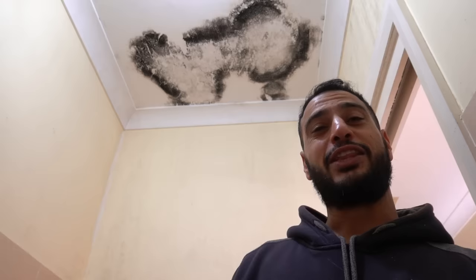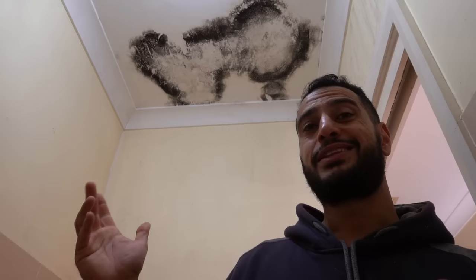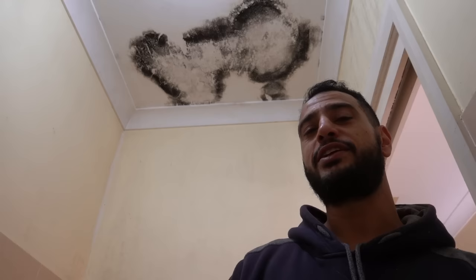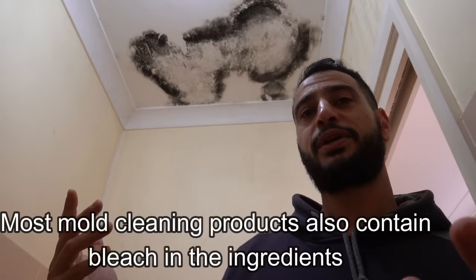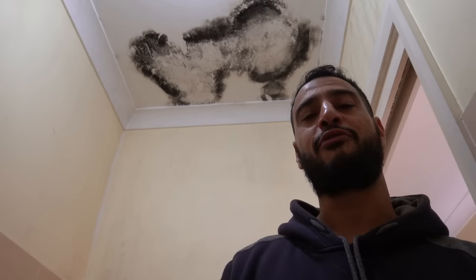The reason I say 'in my opinion kill it off' is because there's so much conflicting information out there. It's a very controversial topic — if you Google 'does bleach kill mold,' which is in fact what I use, you'll find a whole range of answers from yes, to no, to it actually feeds the mold. I'm going to show you how I clean it off using bleach and to be honest I haven't had any issues. I've been doing this for over 10 years and every single time I clean it off with bleach and come back years later, I've never come across the mold reappearing.